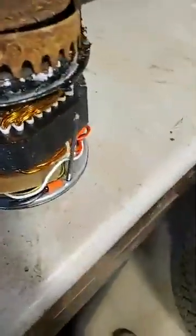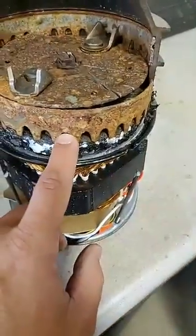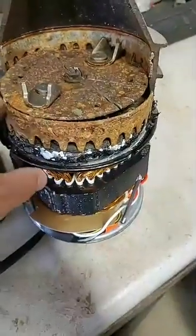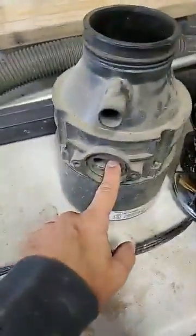As you can see, it would look like this. Everything on the disposal side would come out through here, which would actually come out even on these teeth here. Basically what's happening is all the particles going down in here get smashed up against those teeth, which forces it out through this hole right here.